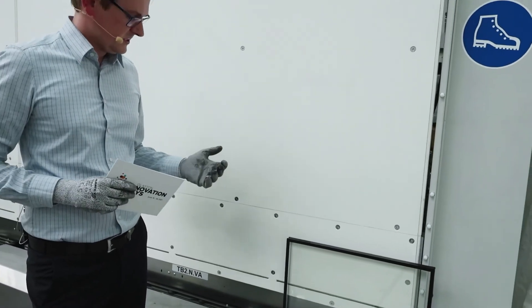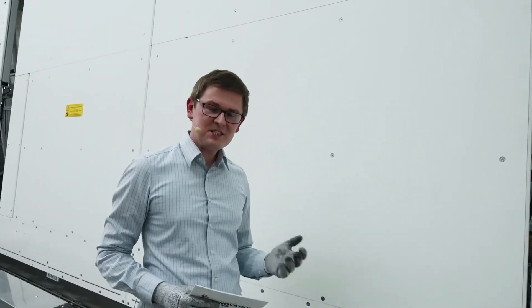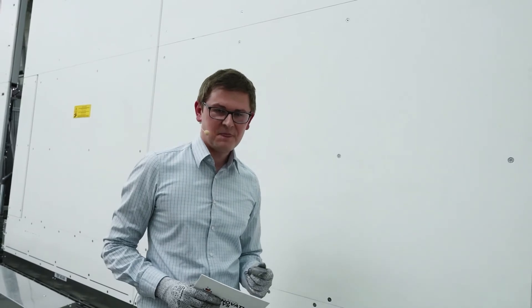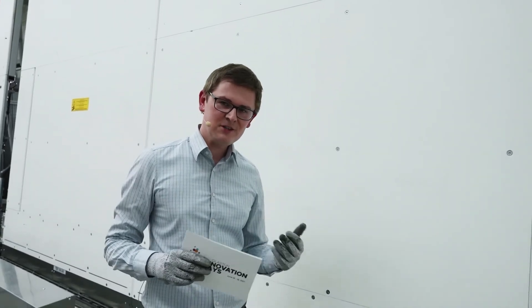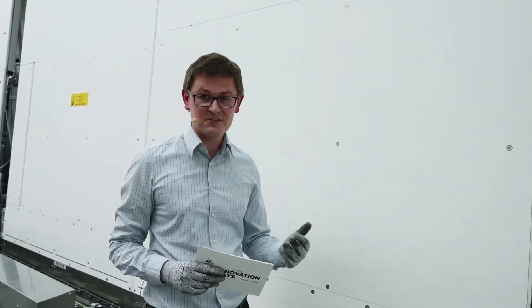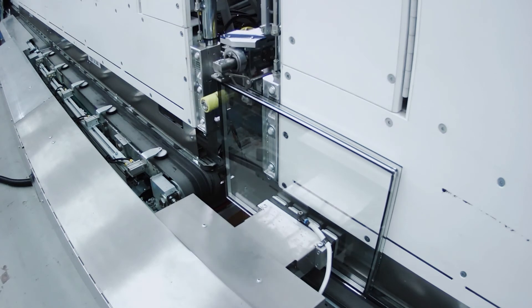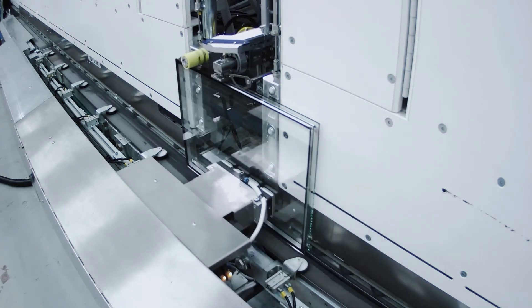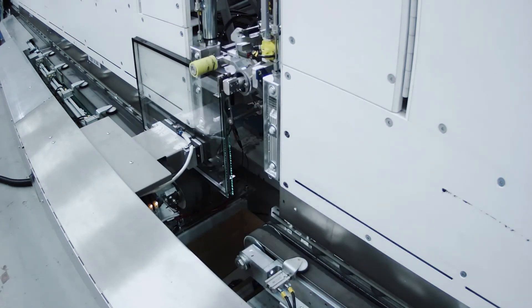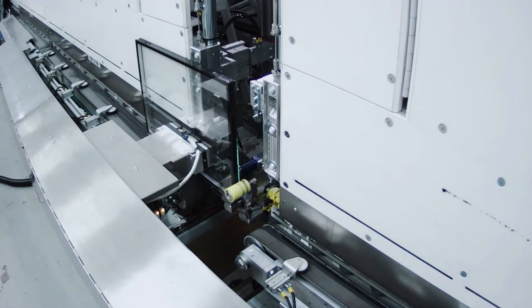Our goal is to have the best quality which is reachable with this process. To ensure high quality, it is very important to keep all the tolerances of the process under control — that means the tolerance of the glass plates and the spacer. With TPS you have a huge benefit because the tolerance of the spacers are reproducible, and that's great.